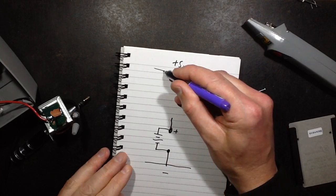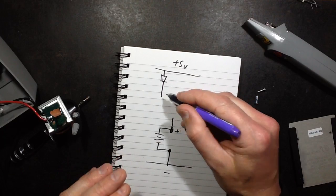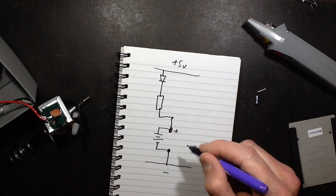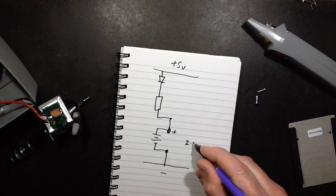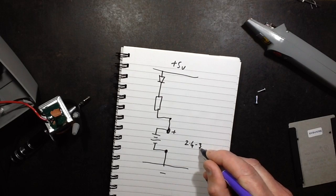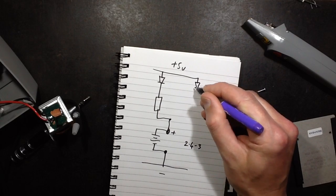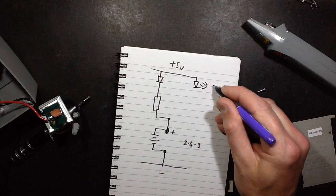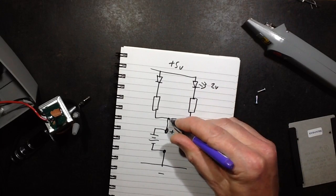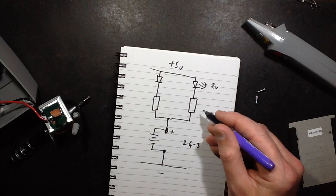And I'm going to use a diode, a blocking diode, pretty much as this transformer has in it, but just blocking the 5 volts DC. And I'm going to use a resistor to limit the current. Plus, because bear in mind this is about 2.4 volts, probably going up to about 3 volts tops when it's fully charged, I'm also going to use an LED here, a red one with a voltage of about 2 volts, and a resistor chosen to limit the current to quite a low level, because all it has to be is an indicator, so I'm aiming for just a few milliamps for that.